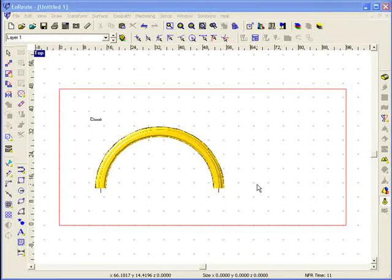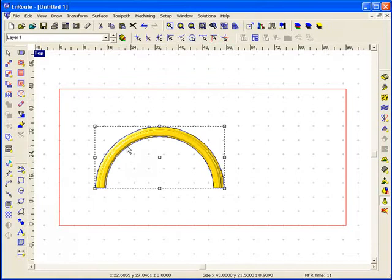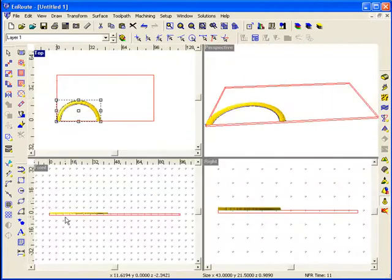In this movie, we're going to show how to toolpath the previously created molding. We're going to start off by getting rid of these 2D contours, which you don't need anymore. And we're going to take this relief and move it to the lower left-hand corner of the plate by hitting the Control button and the 1 from the number pad to the right of the keyboard.